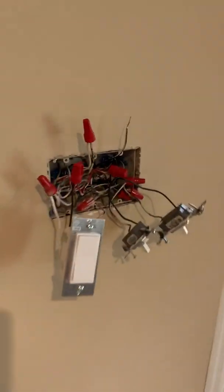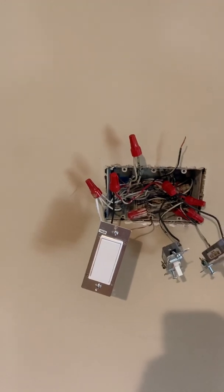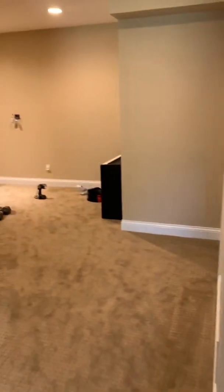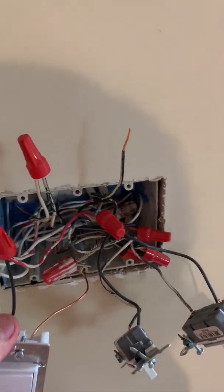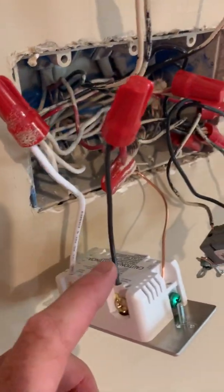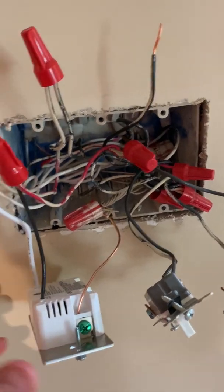The way I have to do this — because the diagrams I've seen show a complete circuit — in most situations you'll have power come from here, back to here, over to there, and then it'll power your lights. But in my case, I've got the master switch over there. So what I've had to do is, on these add-on switches, all you have is a neutral and the traveler. So I had to splice my travelers together.